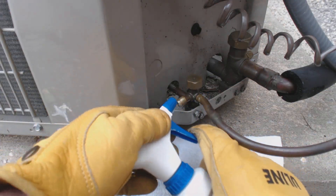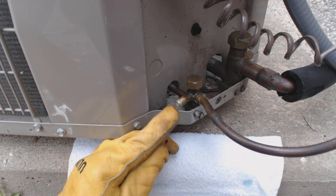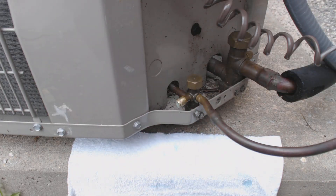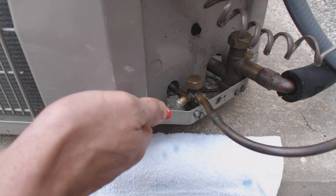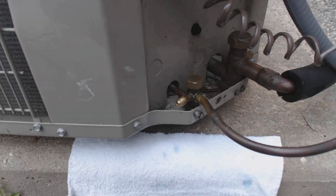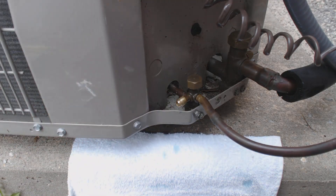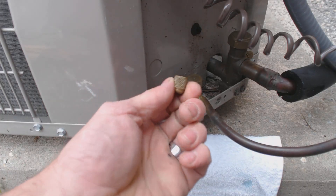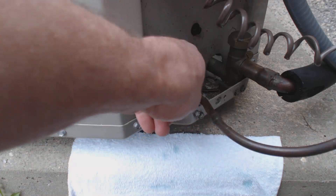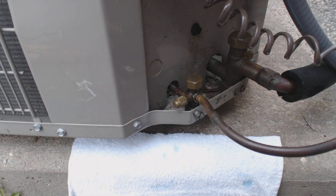We're going to check it again just to make sure there are no leaks this time. Just take a look at the bubbles for a while — once again, if there's any movement in the bubbles, that will be an indication of a leak. Or if you see a large bubble pop, that will be an indication of a very large leak. So we're going to go ahead and blow that out and make sure that the bubble leak detector is no longer there. Then you just go ahead and put your valve cap on. There are different valve caps: plastic ones, brass ones with a flare front, and brass ones with rubber inserts. This happens to be a brass with a rubber insert. Make sure you don't get any sand into the Schrader valve or anything like that, just to make sure it doesn't make its way into the refrigerant lines. Hope you enjoyed yourself — see you next time at AC Service Tech.